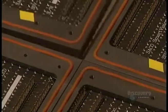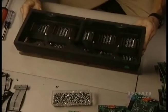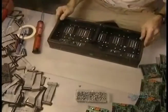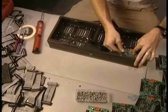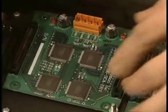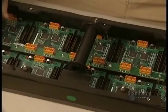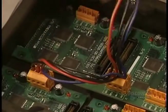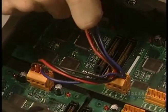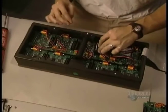The matrices are now assembled together. Ten matrices are joined to make up a module. They insert the signboard conductor, then the wires are connected. These wires transmit electric current and all the information relating to the sign. The elements require a very low voltage current, about five volts, and each module is then provided with its own converter to maintain a steady voltage.